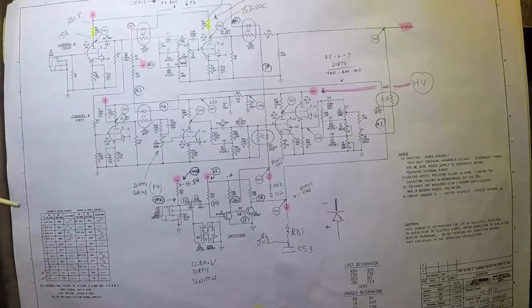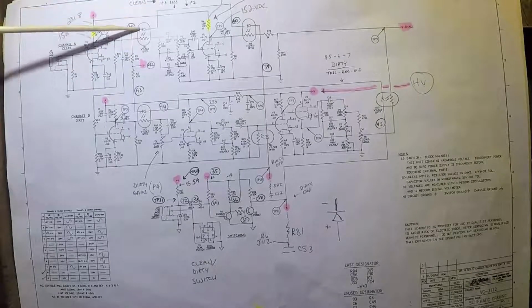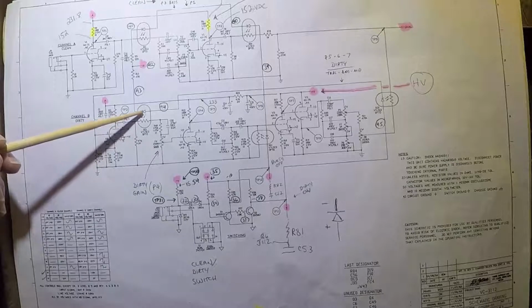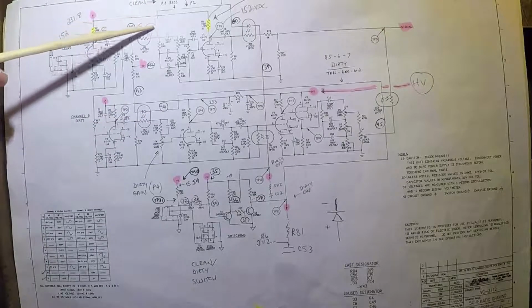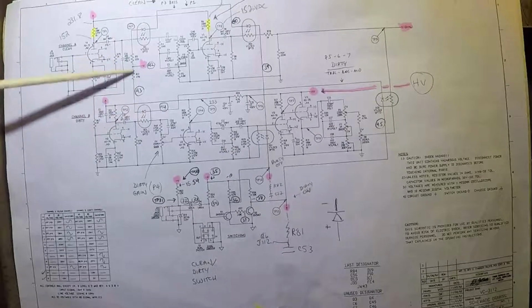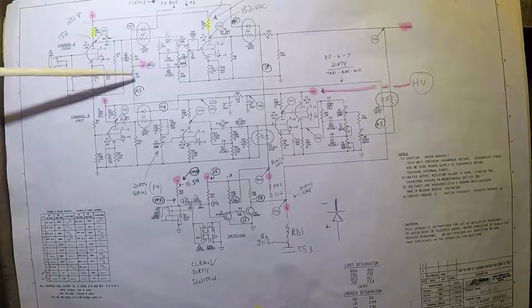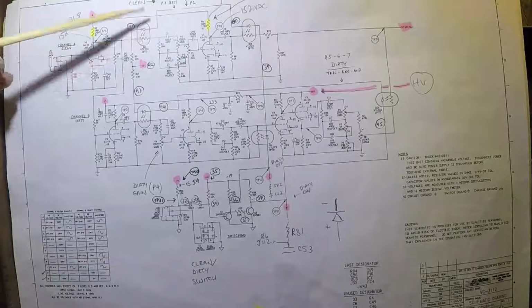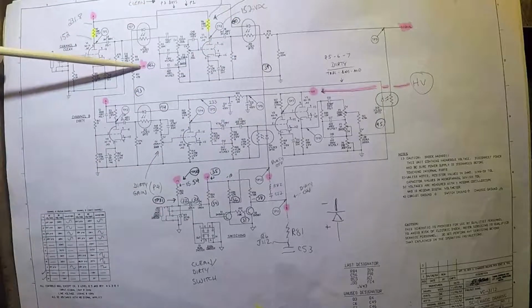And by the way, diodes are also used in the newer amps as rectifiers for turning AC into DC voltage. It's the same sort of thing. So you've got the voltage coming down this way. Now look over here, and you can see that the Opto-Coupler's LED diode is actually facing the opposite direction, right? So when the voltage comes down this way, it can't go this way, and vice versa. When you've got voltage coming over here, it's prevented from going through the LED of the clean circuit. So you've essentially got two circuits here with the voltage going in different directions in a way that they bump into each other and they dump off here.